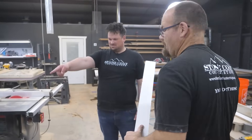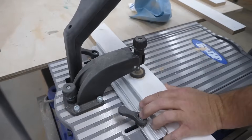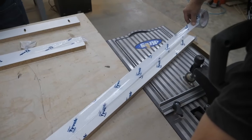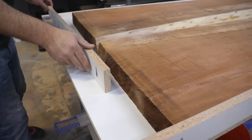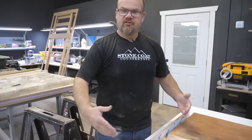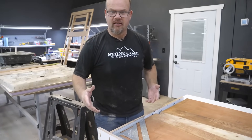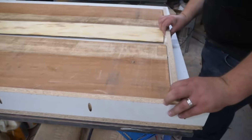Time to add some pocket holes in our verticals for the side pieces of our form, then butt the final long piece to these 36-inch true cuts to keep everything perpendicular and parallel for a professional finish. Using a speed square can keep your form square on at least one end, so you only have one end that's slightly pinched and less to cut off when you're done. Keep the end with the most wood square — you only trim one end when finished. That's a pro tip.